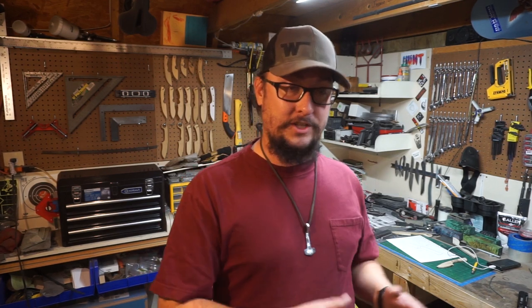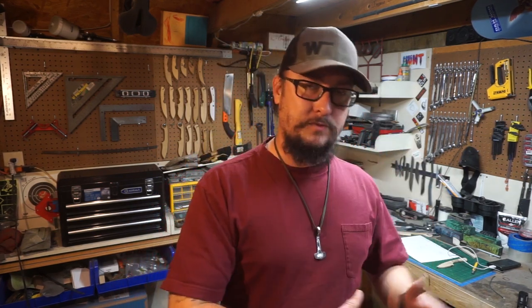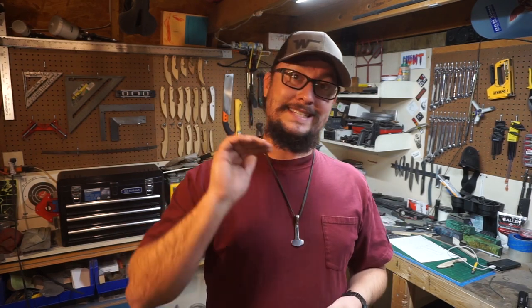You're going to have a good chance that whenever that person tries to baton that knife through something, they're going to crack it, because that huge grain structure is going to cause little areas that it can snap whenever they actually try and beat on it. So a lot of this goes into the metallurgy part of this, and making sure that you take your time to normalize, to do the right heat treat process, and to make sure that you do test pieces with the steel that you're going to work with if you've never worked with it.